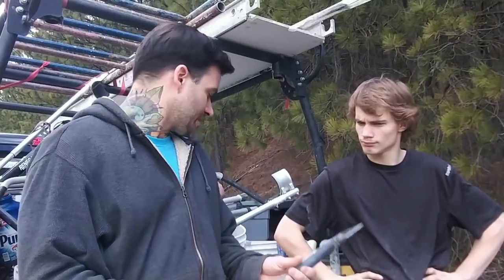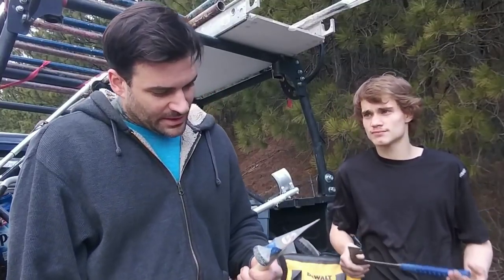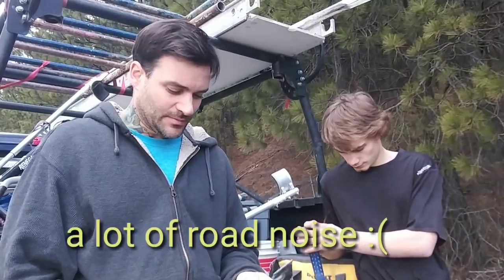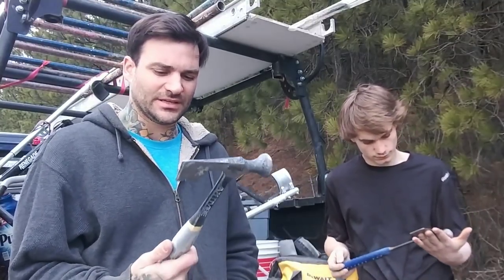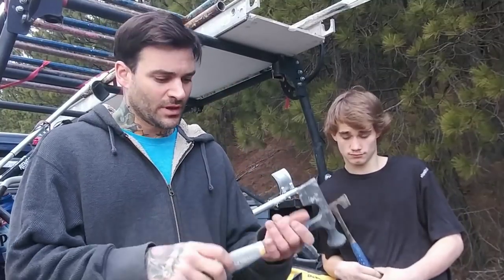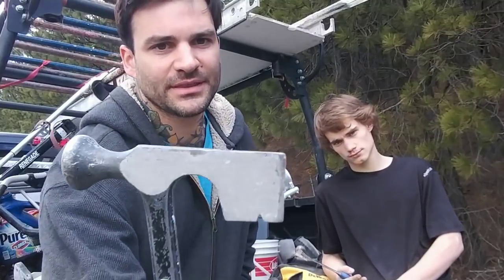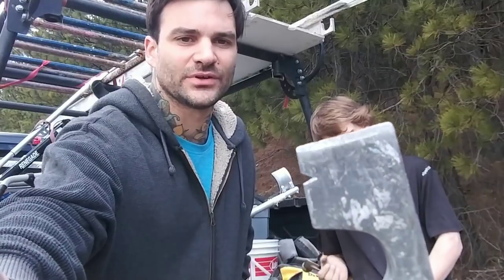First, let's talk about the $30 hammers that most of you are probably looking at right now. They're in most Home Depots and Lowe's and any hardware store that sells Stanley. I've been using this Stanley Anti-Vibe, it's a 14-ounce. I like the weight to it — it feels like a hammer in my hand and it doesn't have much recoil because of the rubber anti-vibe handle. It works pretty good for drywall, cutting out little pieces, and it's got a little notch there for pulling out screws or nails.